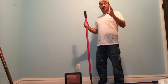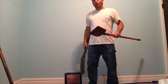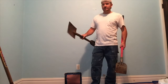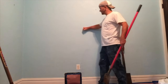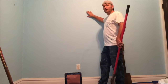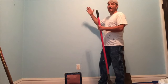This is how you take down plaster. The tools I've found best are a small flat-end shovel or, even better, a tile scraper if you have one — they're not expensive and will save you time. You can use really anything with a flat edge. What you want to do is bang on the wall, which disconnects the plaster from the lath. The plaster holds on to the lath by being forced through it and looping over. You do not want to take the lath down while you're taking the plaster down — that is very important.